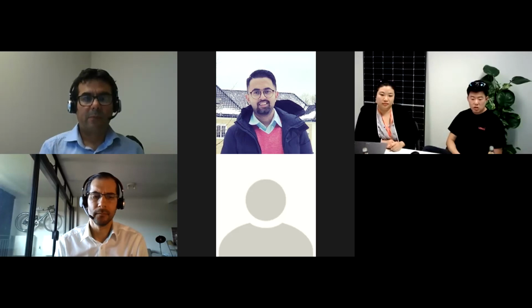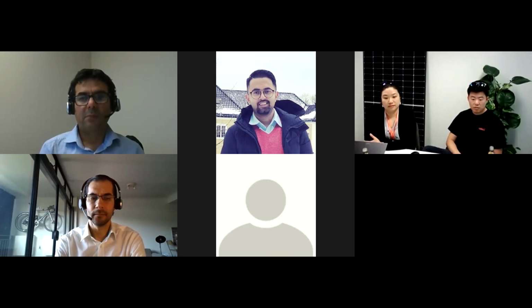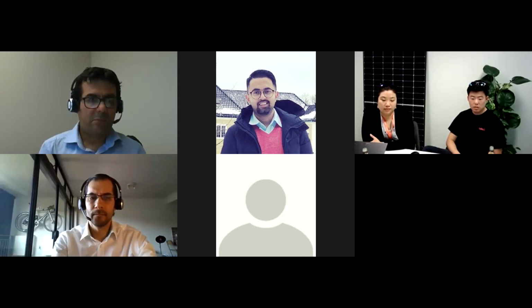But also, as I mentioned on Andrew's question, some of the benefit of using a bifacial module on small scale applications is that the degradation is lower. So basically you can have more yield, more energy gained from the panel, and also the 30-year performance guarantee as well. So that's the main benefit of using the bifacial panel.